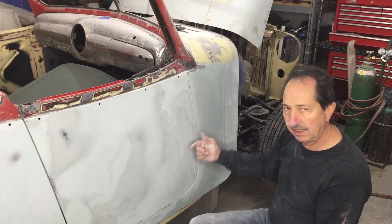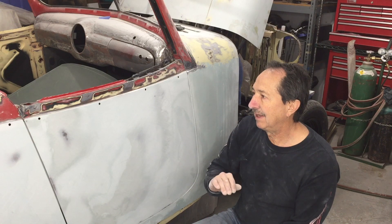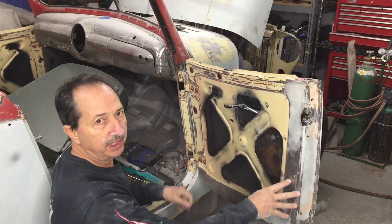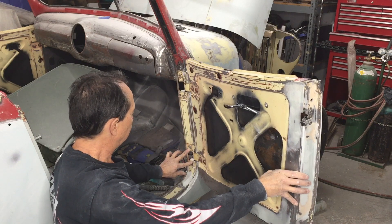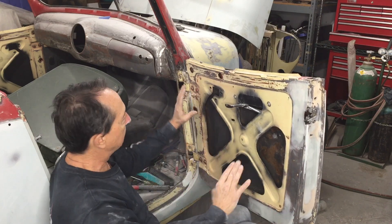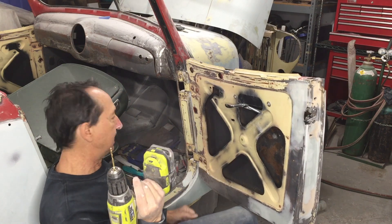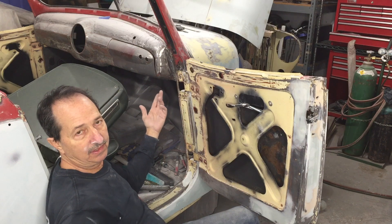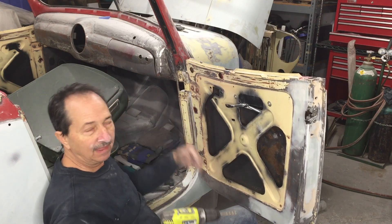Now I've got this door jamb all roughed in and the door fitted perfectly, I need to get this door out of the way so I can finish it. Every door I've ever had that I've taken off, I have a heck of a time getting it exactly back where it was. This door hinge is really difficult to get to move at all, up and down. So if I leave these on and take these four bolts out I can just slide this door off. When I slide it back on the door moves all different directions and it's really difficult to get the line back up. So here's the tip: take an eighth-inch drill bit and drill through right between those bolt holes — you can do it in other areas too — and then use those guide holes. Just put that eighth-inch drill bit into the hole and everything's lined up.